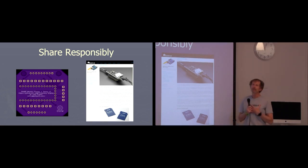So what I usually do, I didn't do it on this board, obviously, is I go into a Gerber viewer, or you can use OSH Park's viewer, and you just look and say, do I see silkscreen over vias, do I see silkscreen over SMT pads? Kind of turn your mind into this graphic calculator. You just turn on those two layers and look at them, and maybe flick the pads on and off and see if something disappears.